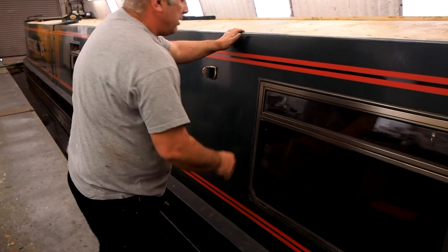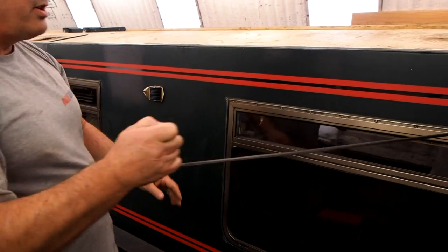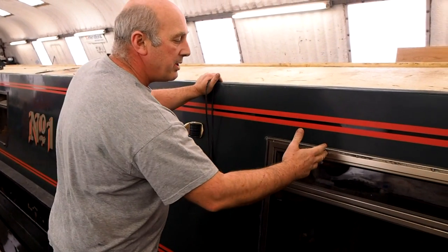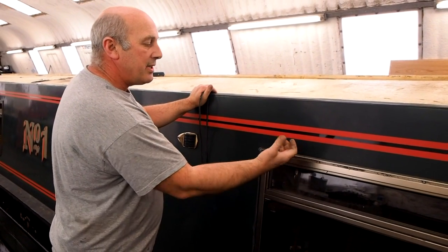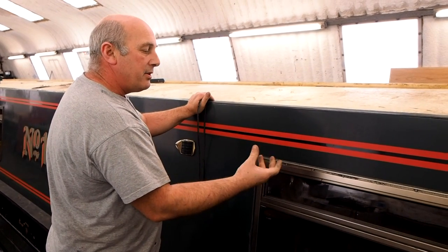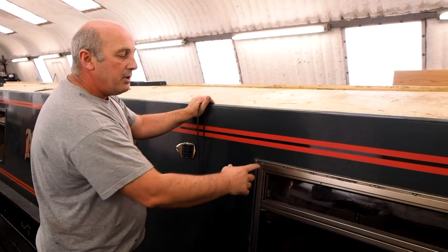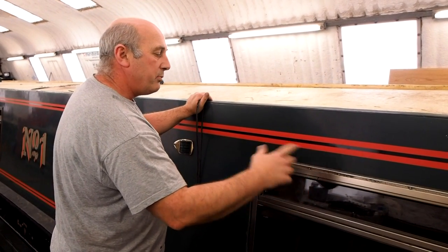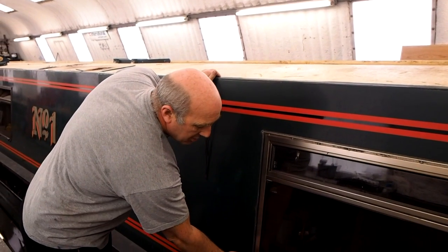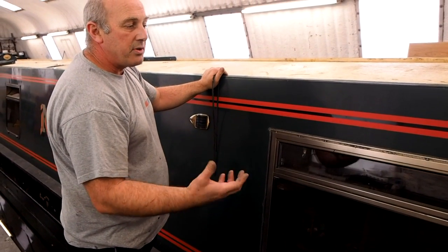Windows that are riveted in, and these windows are riveted in, often suffer from rusting around the edges. This is usually caused by the window being put in, riveted, the window's pulled up once as the rivets take over. Any contraction after that or any subsequent settling of the window, you can't tighten them up. And we've often found a riveted window will actually then at some point start showing rusting or even leaking when moisture has been able to penetrate.